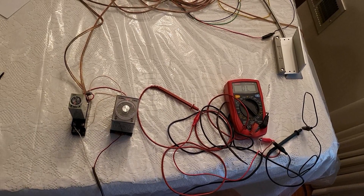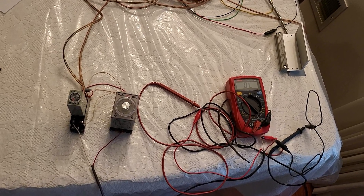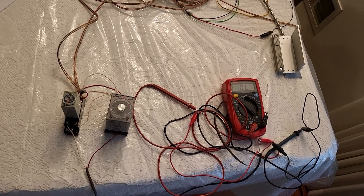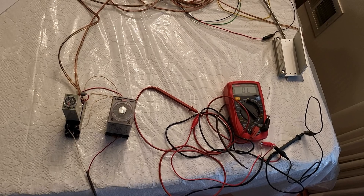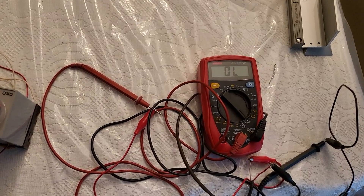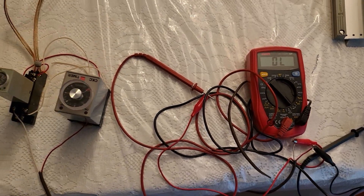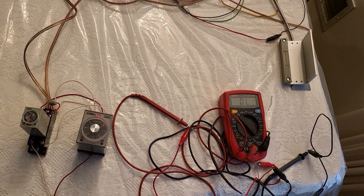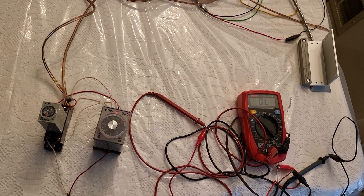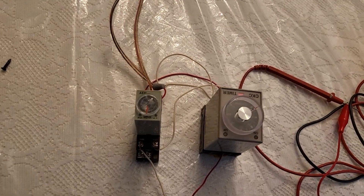Before actually installing the device in the garage, I prefabricated it to make sure it would work the way I want it to. I set it up on a table, but instead of controlling the garage door, I'm going to have it control a volt-ohm meter set to continuity — when the two terminals jump each other, it beeps. I'm going to simulate pressing a button, and it's going to do so after five minutes, because I want it to happen when the garage door has been open for five minutes.